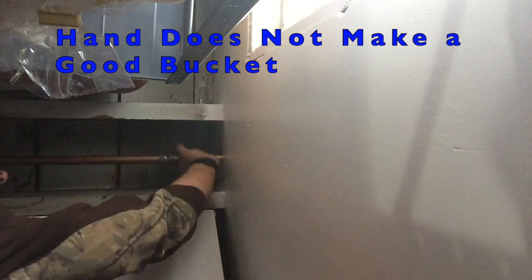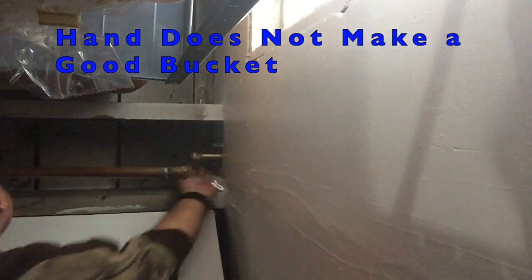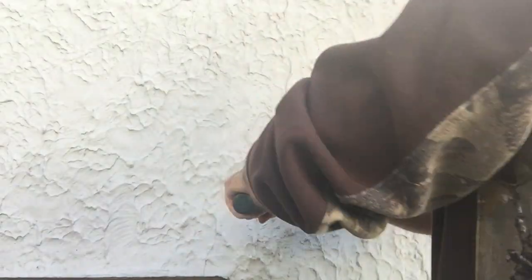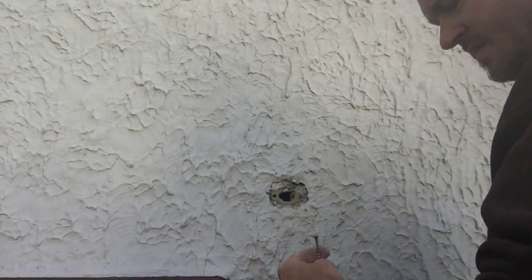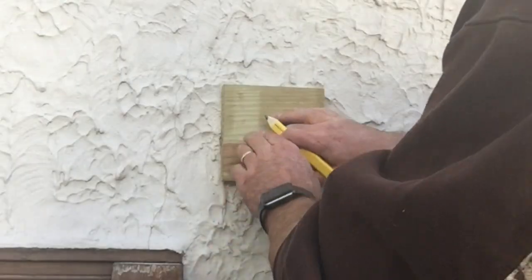When doing this, I shut the ball valve off, but as I'll discuss a little bit later, the ball valve was actually letting water through, and you can see here that a little extra water came out. Then I removed the old spigot, and the screw and the plastic pieces that held it in place were all busted out, so I had to remove those.